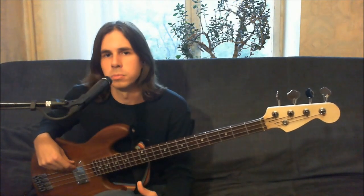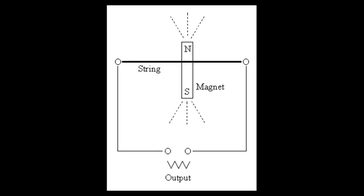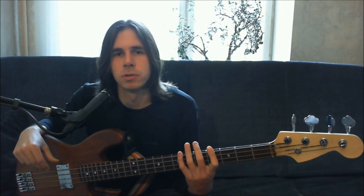So what's unusual about this instrument? In traditional electric guitars the output signal is collected from the coil of the pickup. But when you have just the string and the magnet, it's also possible to get the signal directly from the string. So I decided to use this principle.